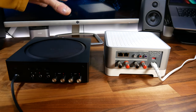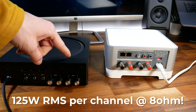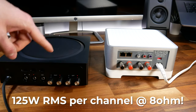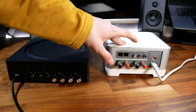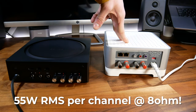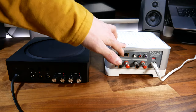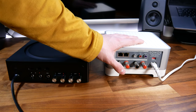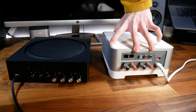Functionally these are also quite different. The Sonos Amp can put out 125 watts per channel into 8-ohm speakers, and it supports down to 4-ohm speakers — with two 4-ohm speakers it can put out 250 watts per channel, which is incredible. The older Connect Amp can only put out 55 watts per channel for 110 watts total, and does not properly support 4-ohm speakers — connecting them might trigger protection mode. Both units do use Class D amplifiers.